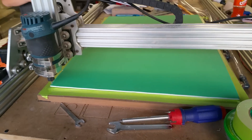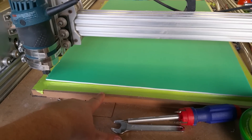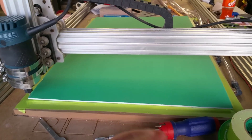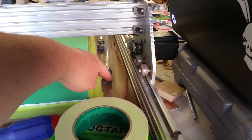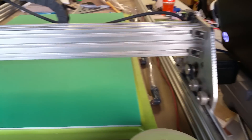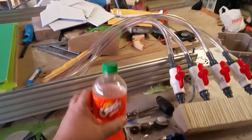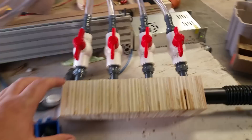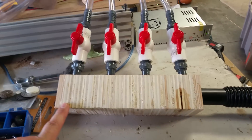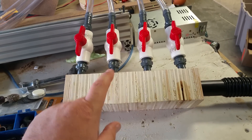I found that 125 inches per minute IPM is the best that works very very well. I also built my own vacuum table out of MDF board. I just went ahead and made a bunch of ditches and slots in the back side and drilled holes in the top side, flipped it over, and went to Home Depot and bought some of these garden fittings — these little elbow fittings. They were 31 to 39 cents each, so that's pretty cheap.